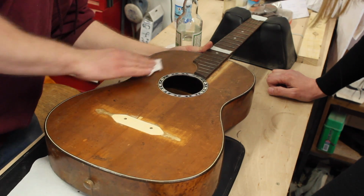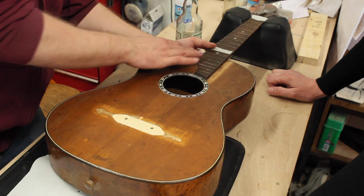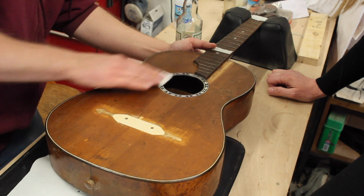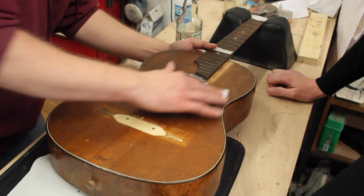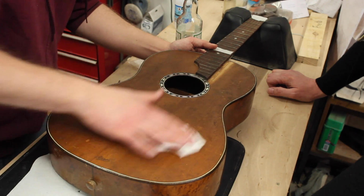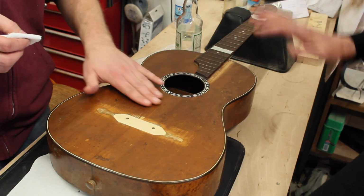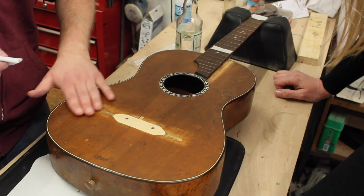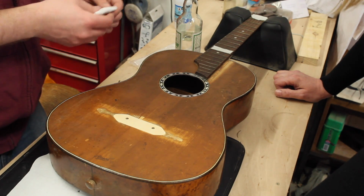What's your feeling about cork sanding blocks? They're invaluable in the right situation. They're not right for every situation, though, because they can leave the surface a bit undulating. Yes. One of the sanding blocks I've got is a rubber-backed one. For this, maybe just a block of wood. Since the surface has some inconsistencies to it, there wouldn't be much point in getting it dead flat because we'd be cutting out different points.